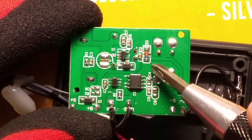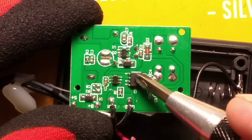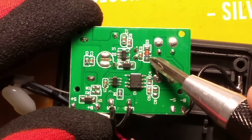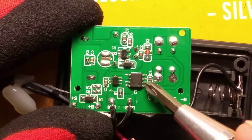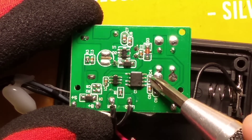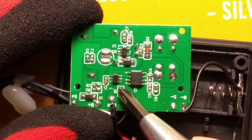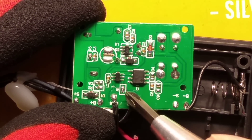What that enable input does is turn on - loosely - the 3V rail, which is used to power everything else. The voltage drops under load of LEDs and only goes up to about 3.7V off-load, so I'm guessing it's a 3.3V regulator, or possibly just a fairly generic regulator. It's possible this diode may cap the voltage. When this turns on, it provides power to the microcontroller. The microcontroller has a button input for selecting programs and appears to have memory for storing those programs - it's a standard tactile click switch toggling an input. There are two outputs going to this chip, which must be an H-bridge driver that lets it drive alternate pins positive and negative - so it can reverse polarity. There's a 1-ohm resistor, and then it outputs to the LEDs directly.